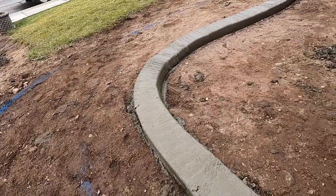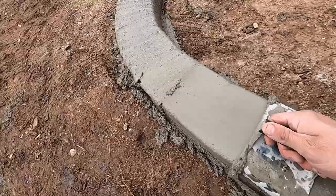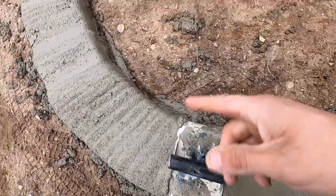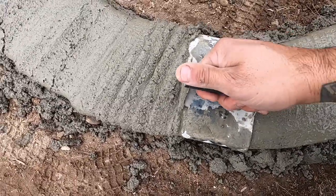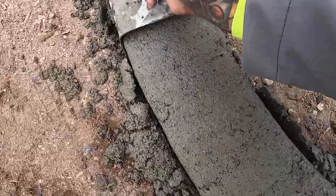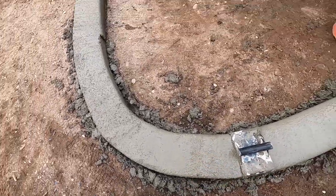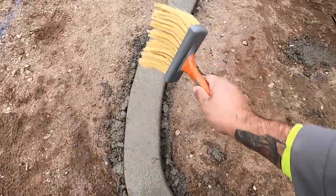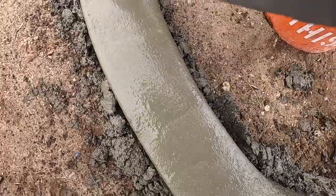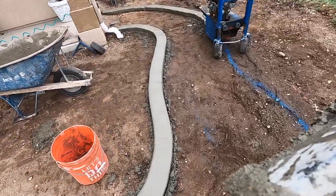These radiuses are the most important, so I'll show you a little bit more detail than these longer swoops. You can see some material got piled on here. What I like to do before I go with the water is tamp it as I start forming it so I can get a better shape. You can see how it's removing some off the sides. Now I'll come back, add some water, and continue the process. Let me just finish this up and show you the end result.